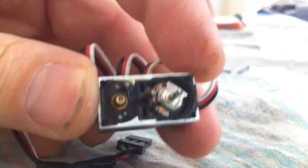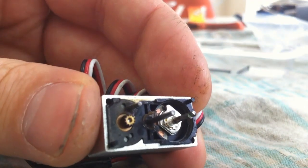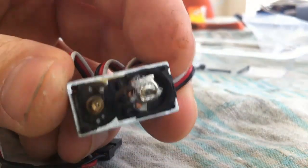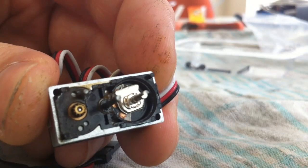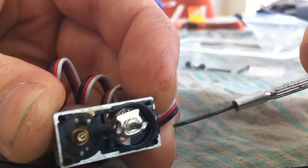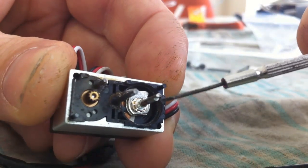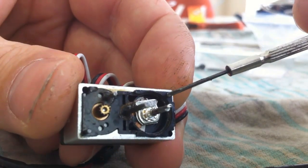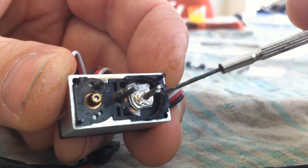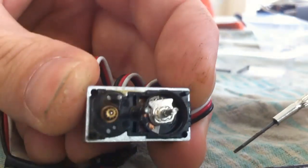Here is our pot. I can actually see a little bit of grease on the track — from about there all the way around to there, there's grease. Basically what's going to happen is the little wiper, which is underneath this rotating part, makes contact with the carbon tracks here. That'll make poor contact and give us the jitters.